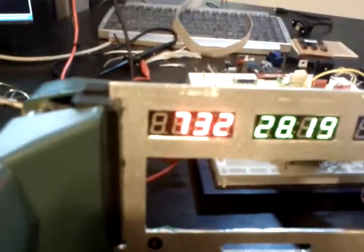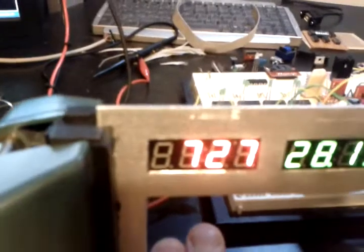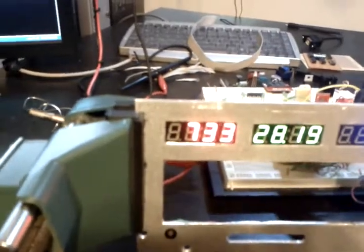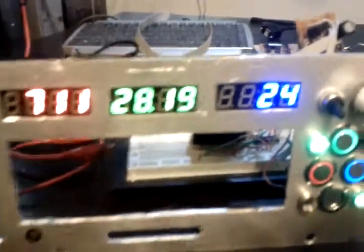There's a CDS cell down here monitoring ambient brightness — it turns the display on. As it goes into darkness the brightness level goes up, and as it's re-exposed to light, with the hysteresis adjusted to make it more responsive, the brightness level goes down. The green display shows the current temperature.